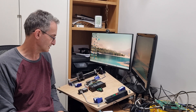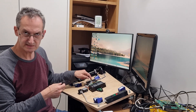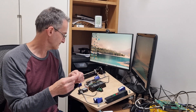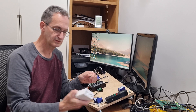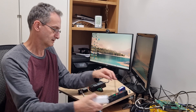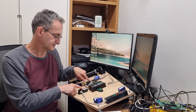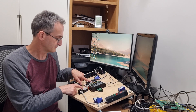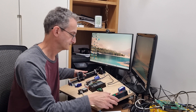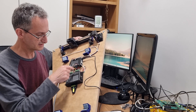How does it work? You have to put power in it. I put 12V into the Arduino — this is the Arduino board. I have here a PD-to-12V power cable that you can connect to a power bank and it gives 12V, which powers the Arduino. And here you have a DC-to-DC converter from 12V to 24V, which gives power to the motor driver, which powers the stepper motor. You can see here 24.4V — that is the voltage that the driver gets.